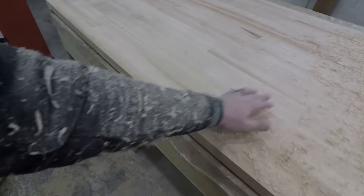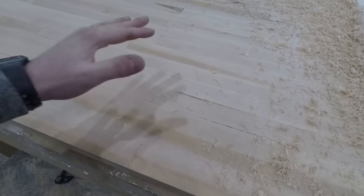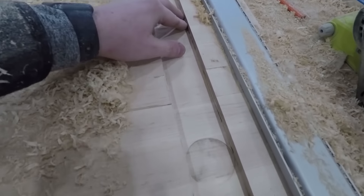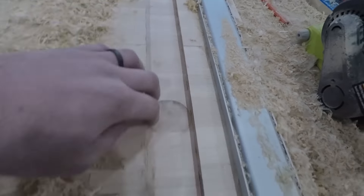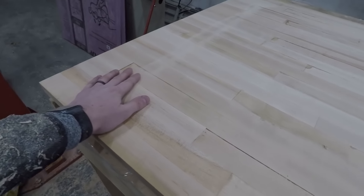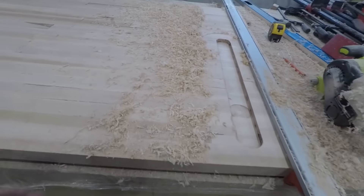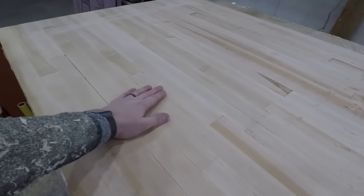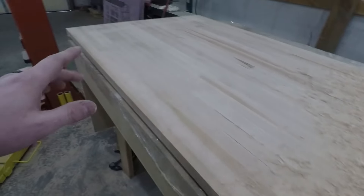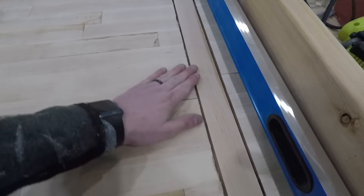I've been sanding for a long time. The top is done. I routered a channel out — probably a half inch deep, three-eighths or so — and I'm going to cut a piece that fits in there and glue it in to strengthen the overhang. I'll do that on both sides, which should help quite a bit to keep it nice and strong. If I still feel like it's weak, I'll just put a brace on the island on each side. I got the pieces glued in, so I'm going to let those set for a little while and then come out and do a quick sand.